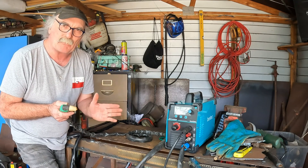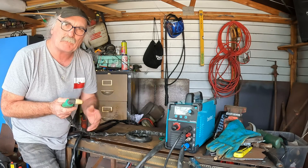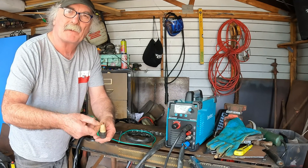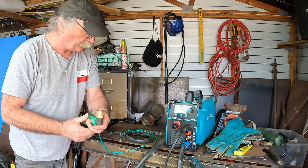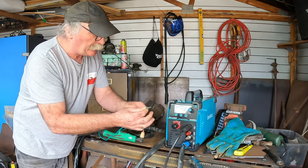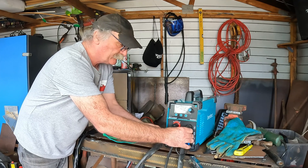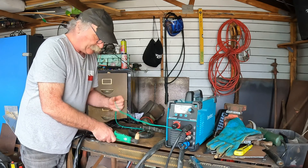So do you reckon that little wire trick would work? Only one way to find out. If we put a wire from the cutting nozzle to the pilot arc connector, will we get pilot arc? All I'm doing is putting this old bit of wire around the end of the cutting nozzle on my old PT31 torch, and hooking the other end up to the pilot arc connector on the plasma cutter machine. I don't know if this is going to work, but let's have a go.